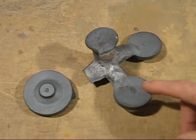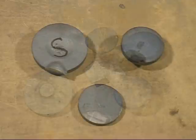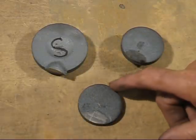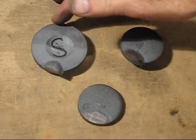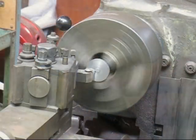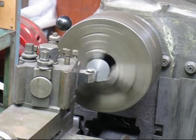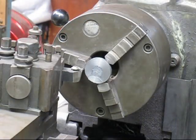This is the next test — I'll be cutting these two covers off. Here are the smallest castings I produced in this pour, and we'll see what they machine like in the lathe and whether they've got any chilling on the edges. One thing I've noticed with the sawdust sand: you'll see very little breakage — it gives a very clean definition around the edges at the parting line. I've taken a facing cut of 0.1 mm. There's a bit of shrinkage on the boss, so a little bit more and I'll be able to machine that flat.